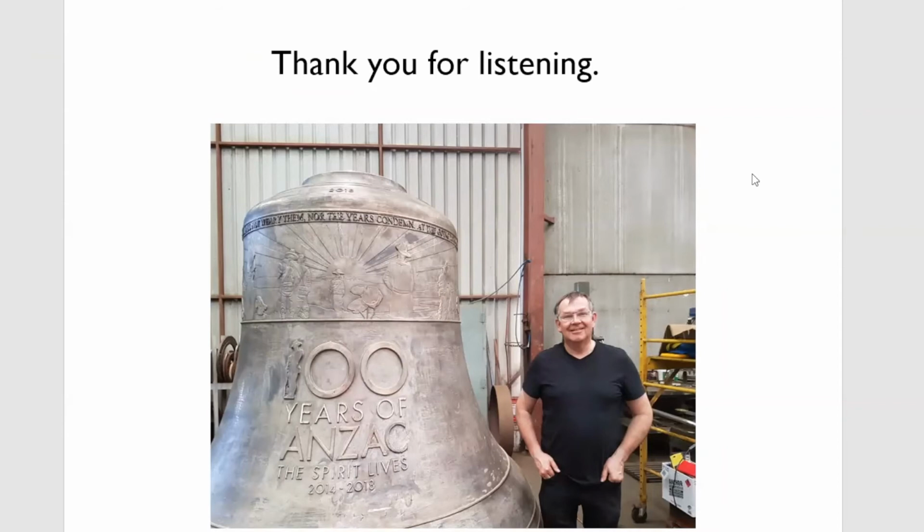Bow, of course, did quite well, not so much because of his bells, but because of his hanging. It was basic, a bit crude with his girder headstocks, but he was quite a successful bell hanger, so he managed to carry on until the late 1930s. But his last ring of 8 was at Malden in 1922, which, as I say, were a complete disaster until they were tuned a few years ago. He was much better at hanging bells than he was at casting and tuning. But really, that's a summary of the history of harmonic tuning and how we ended up where we are today.